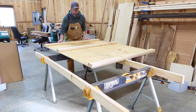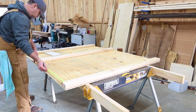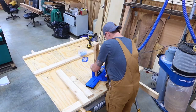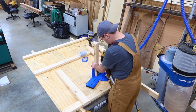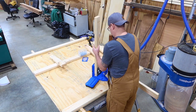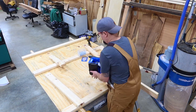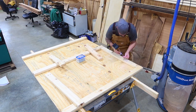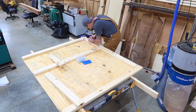This will allow you to actually put the coat hooks in later and have something stable to drill into. Since the beadboard is a little less than a half inch thick, I'm going to be using about an inch and a quarter screws just to hold these in place. Once all our panels are nice and screwed down, we're going to flip it over and finish out our frame — take our measurements, make our cuts, and fasten everything together. I'm going to be using pocket hole joinery, and these sidebars for the frame will make sure that everything is straight and sturdy.